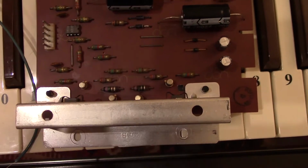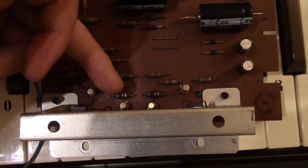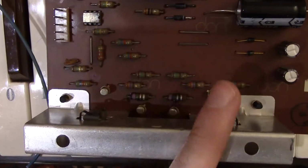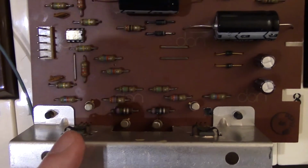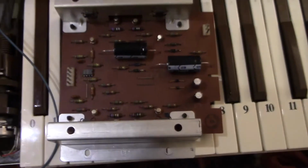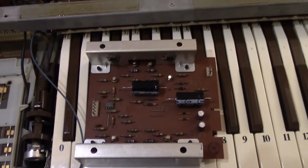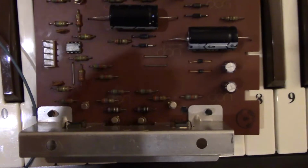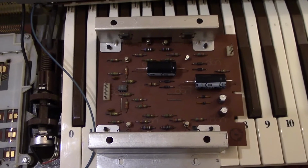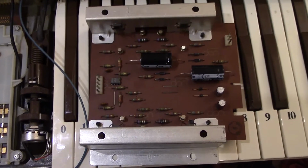Okay, that was good timing because the camera battery ran out. These two 0.75 ohm resistors have burnt up, and that is because I can't remember exactly which, but one of the output drivers on this side has gone dead short both ways. One has gone partial short. I found someone else on the Optigan.com website that seems to have the same problem. I'm guessing that these old Motorola transistors are just notorious for that at this stage in the game, really. It's all 1972 marked. They're all complete unobtainium.